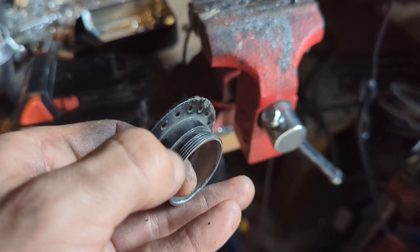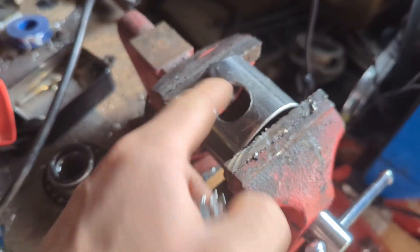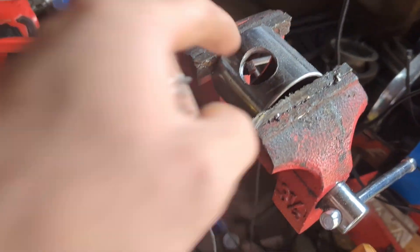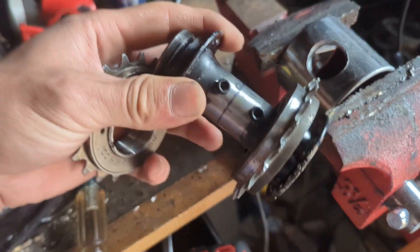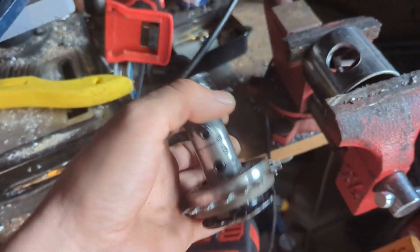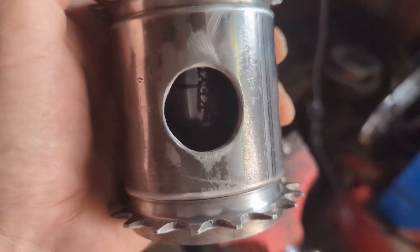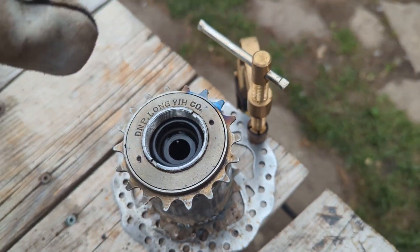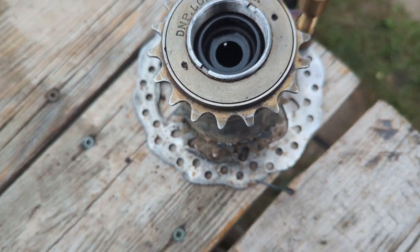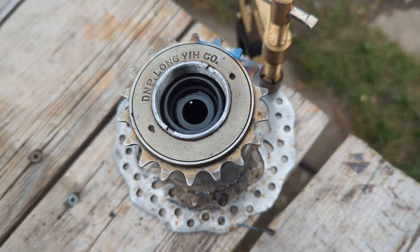Now I gotta figure out how to press it on, and hopefully the gear threads on too. I probably should have drilled this big hole while it was still like a big pipe — that would have been easier, but whatever. The hole is for accessing these screws that are going to be inside. You can see the inner portion spins. I tried to do the bead weld stuff but the gear wasn't too happy about that, so it's going to be lots of tiny spot welds.